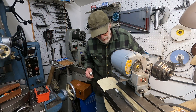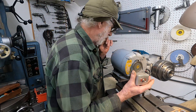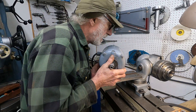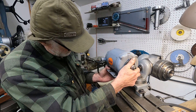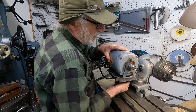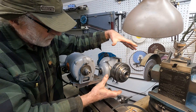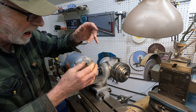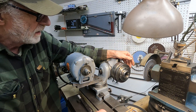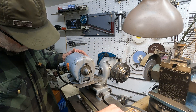This thing's turned around, so I've got to reverse the motor here — let's see if I can do that without dropping it. Pull it off... it's got a key thing here. This is kind of a custom motor setup. I've got to move the bolts to the back. The original factory setup has a really giant pulley and a heavy higher-speed motor — it causes vibration and is unwieldy. A lot of people just find a 1100 RPM motor and do a flat belt like this, which works really well.